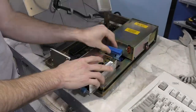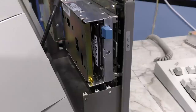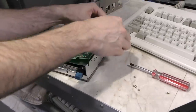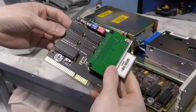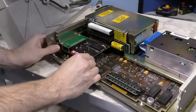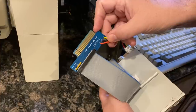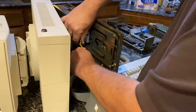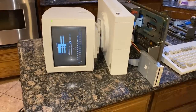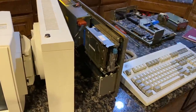I tried a 720K MS-DOS disk, and after pressing F1 it does attempt to read the disk, but ultimately doesn't boot from it. I took one of the drives apart to see if they were gummed up or had broken belts, but I couldn't find anything wrong. Then I thought I'd try an XT IDE card to see if maybe I could boot from that. However, not surprisingly, it didn't work — the PS/2 line of the same era is known for having a BIOS that doesn't support option ROMs on expansion cards. I took it over to my friend Kevin's house. He makes and sells little adapters that allow you to use a standard floppy drive in a PS/2 style system, so I thought maybe we could try one of those. It fits in there just fine, but the light comes on, the drive spins, and it still doesn't seem to want to boot. Kevin also took a known working drive from an IBM PS/2 and put it in — it fits perfectly, but still didn't work.